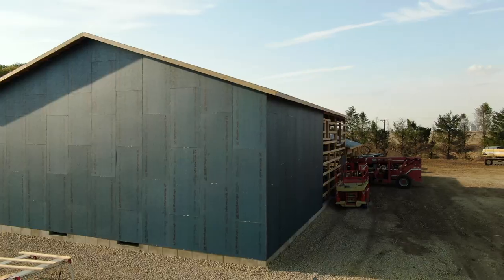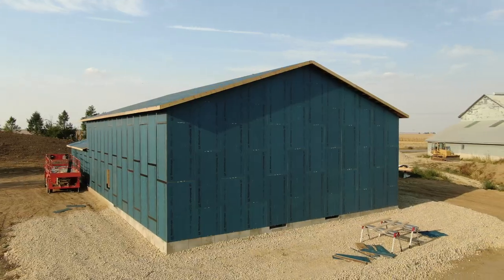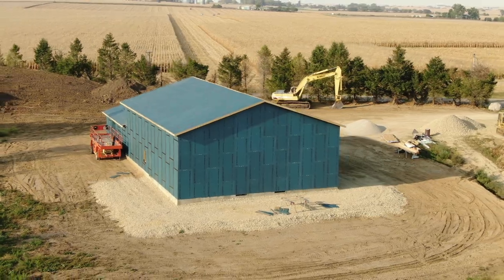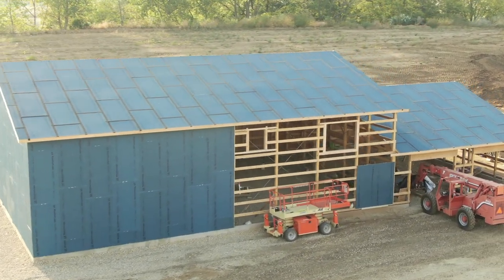And if you're looking back there and it doesn't look flat, that's because there are a bunch of big window openings in there and we can't necessarily fasten the sheets in those big open areas. Also, we don't have any of the field, through the middle of the panel, very rarely. Once in a while we tacked it, but all of this needs to get fully nailed off. We've got to do a 6-inch perimeter nailing and a 12-inch nailing through the middle. So that's the nailing pattern for the LP Weatherlogic.